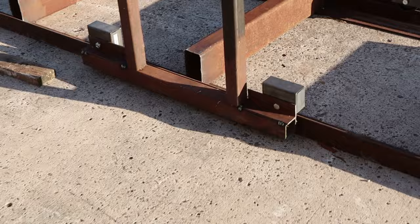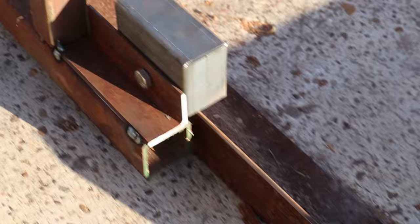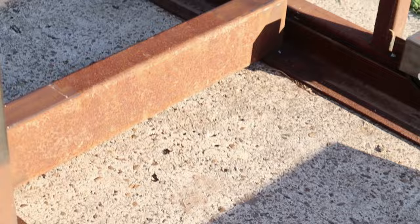We've got our boxes mounted, again tack welded, on the bottom. And if you see how we set these up, this is a little different than we normally do. There's actually 4-inch wheels inside those boxes, and they're elevated a little bit higher than the 2x2 square tubing there, so it'll drop the carriage down. Now later in the video, I'm going to put a slab of wood up there to show you why I did that. And there is a reason for this.